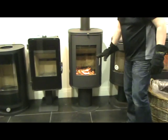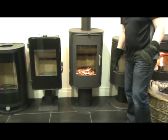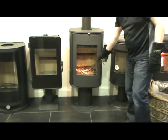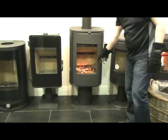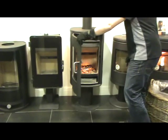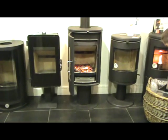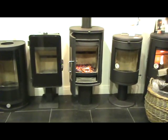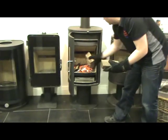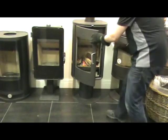The pre-fire has burned down. We've got a couple of nice coals here so we're now ready to put our first refuel in. I'm going to open the door quite slowly just to make sure no ash comes out. Opening the door can change the pressure of the stove slightly, so we generally just open and hold it for a few seconds before opening it fully. I want to do this reasonably quickly so the chamber doesn't cool down — we don't want to burn the stove with the door open for long.